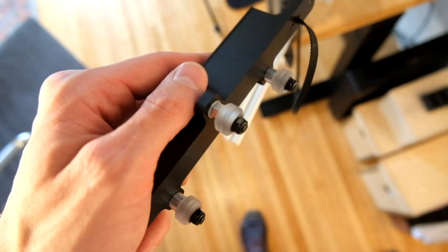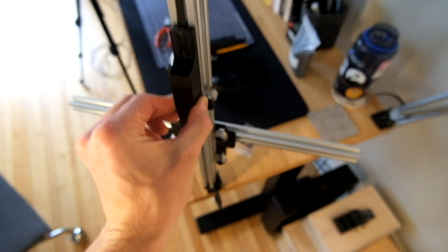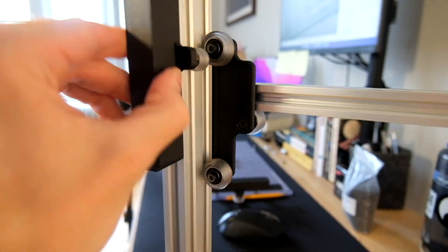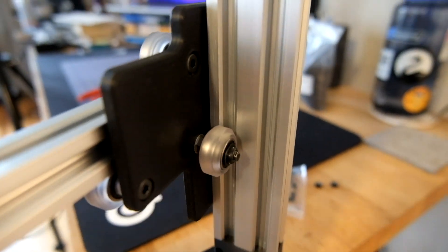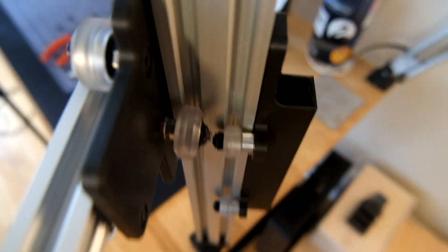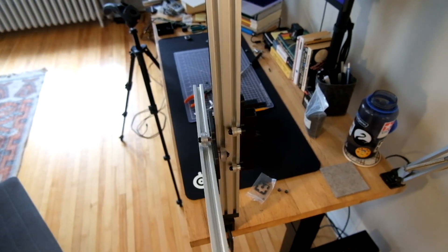With everything assembled and the belt attached I can put it on the lamp and see how it works. I'm not using the ultra low-profile nylock nuts on these because they actually interfere with the wheels, so we'll have to see if these hit the carriage. Okay, feels pretty smooth — let's see if they hit. Yeah, they touch — I'm going to have to switch these out for the ultra low profile. With that modification made they don't hit at all — they're actually not even in danger of hitting, because with this combination of smaller wheels and low profile nylock nuts they don't even overlap anymore, so they're never going to hit.